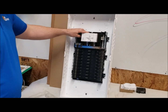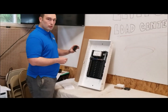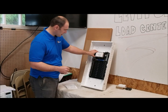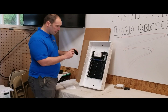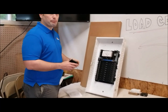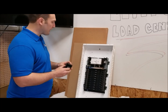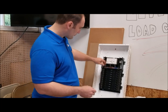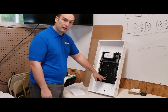This is a 100-amp main breaker — I ordered this one for my shop. We have some little covers for the line terminals that snap in nicely, and concentric knockouts. A lot of the new panels have these little rubber boots to meet the new code change. We've got a 100-amp breaker here and then a hot bus down the middle, just like a traditional panel.